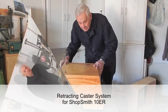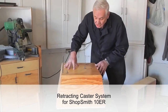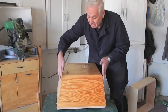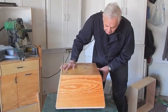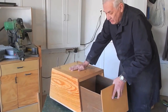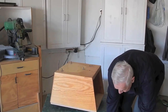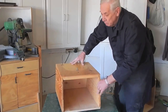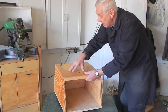There it is. This is the main carcass for the base of my Shopsmith stand. It's made in a somewhat pyramid shape to give lots of stability when the tool is in the upright position. A crude drawer fits the opening, made out of salvage materials. The construction is very simple: three-quarter plywood sides, floor, and a one-and-a-half inch top.